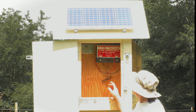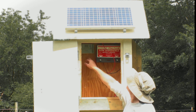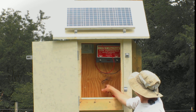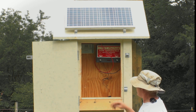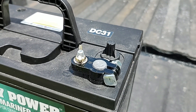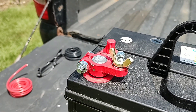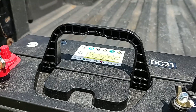One thing when you're hooking these up: always have your battery connected to the solar charge controller before you hook your solar panel to the charge controller. Always battery first, then the charge controller. The other nice thing about these clips is if I want to go into the garden, I simply unhook these and the fence is off. At Tractor Supply I was able to find these battery terminal clamps — they have a little wing nut on them that will make connecting and disconnecting the battery source a lot easier. It's always nice to be able to disconnect the power if you need to.